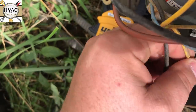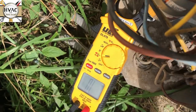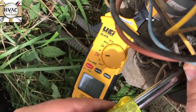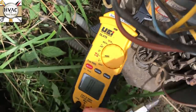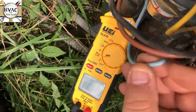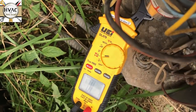So we're going to hook it back up and try the breaker again to see if we hear the compressor attempt to start. We know the capacitor is weak, but it's reading 26 out of 30, which is enough to start the compressor. It still needs to be replaced, but I'm going to see if it even attempts to start, then we'll put a hard start on it and see if that'll break it free. If not, they're going to be looking at a new unit.